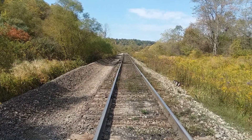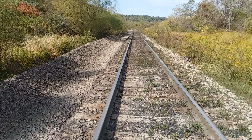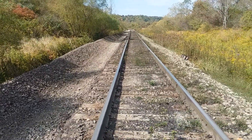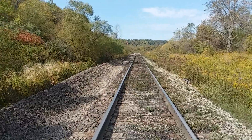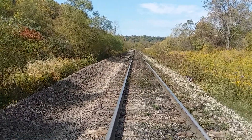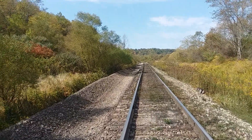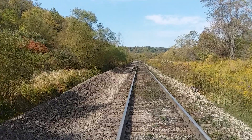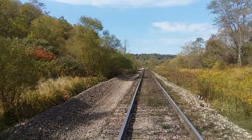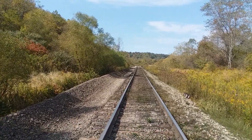When I come up here and make a plot on the curve with the tamper, I'll come back after I'm done, set the curve up, and come back here and start at this plot tag. For you guys that watch the Beelin rail cam like I do — you look out there and you see some of the sets of rails have orange paint marks on them. You probably wonder what those are — those are plot tags. That's where the tamper will start a new plot.